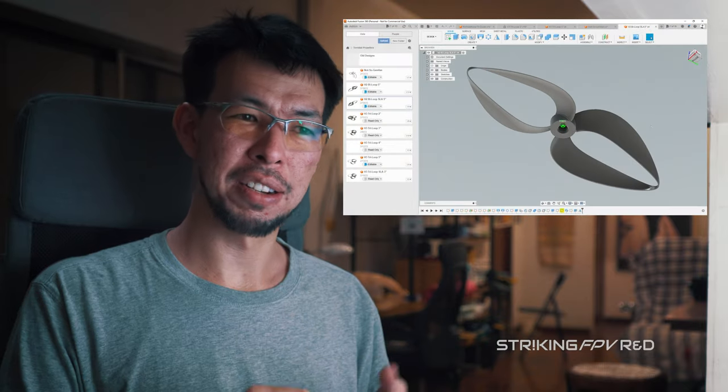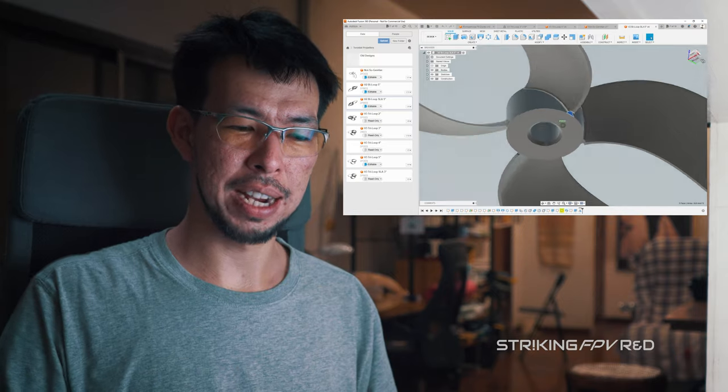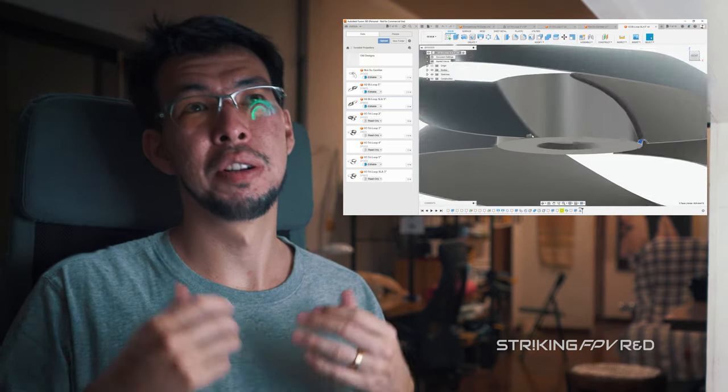Anyway, so cupping blowout. I'm aware of this issue, and for now, if you don't mind, place your own little drain holes to relieve the stresses if you can. But I am planning to do a run of SLA-friendly blades that are going to have thinner bases and tiny little drain holes for the hub section and especially for the blades, which hopefully will make the printing process for resin better. But if you have more input on how to solve the issue, then please leave them down in the comments below, like the kind commenters from my last video who brought this to my attention.